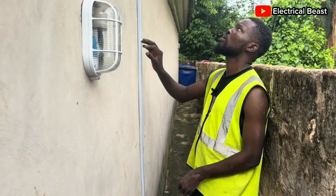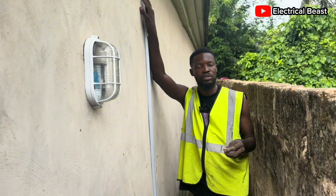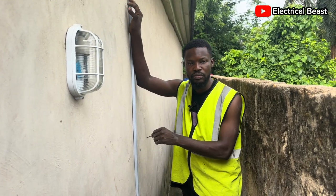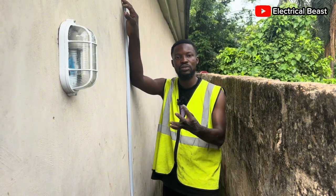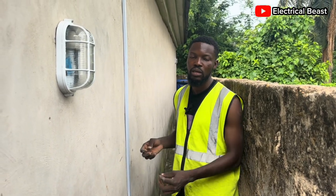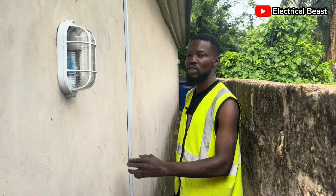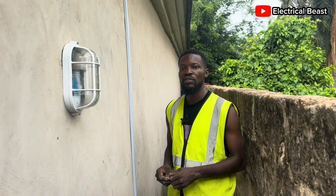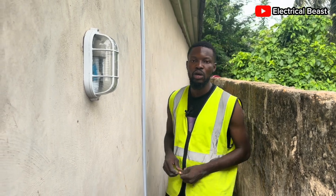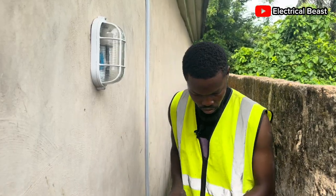Right now I'm going to take this wire — it's already on the roof — and go screw it to the profile. There are different ways you can do it: you can screw it to the profile, connect it to the frame of the panel, or even put it on the roof. I'm going to screw it to the profile because everything is connected together — the roof, the profile, and the panel frame. They are all conductors: metals, aluminum. So when you connect one panel to the profile, it links all the other panels as well as the roof. You don't need to connect one after the other — that's a waste of materials. Let's go up to the roof. Follow me.